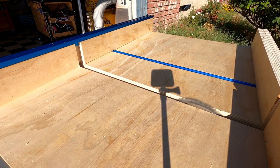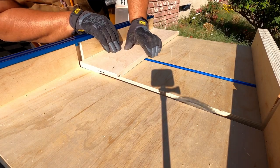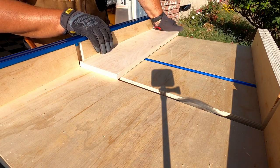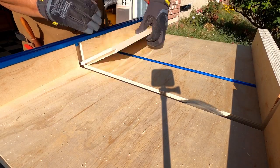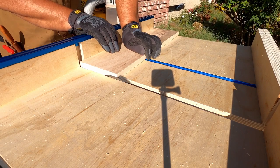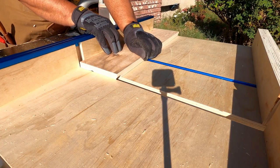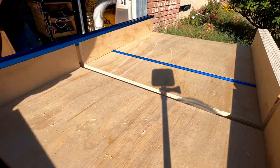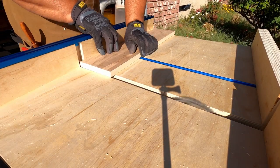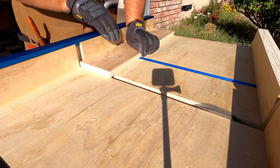I have a good side and a bad side of these pieces — the bad side is facing up because I want the good side, which is the maple, facing on the inside. I don't know what Home Depot uses on the back side of maple plywood, but it's not the same — it has a different color and grain pattern, and that's probably what's causing the warping, because you have two different types of wood on one side. This wood also had a lot of open gaps, which made some pieces difficult because when you screw into them, the screw would just break apart the piece where there was an open gap inside.